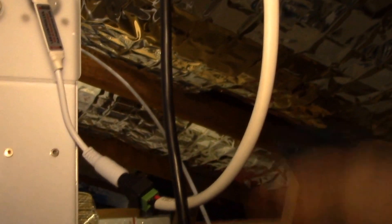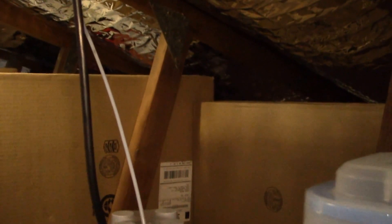That should work a lot better and it'll be easier to change filaments — I'll just pull the tube out, it'll be loose at this end, and I can feed the filament through the tube and shove it through the filter in the back. The other change I want to make is putting the feed-throughs up high instead of down low, to cut down on the amount of bending in that guide tube. Every bend adds friction, so if I can come off the top instead of the bottom I'll get a much better feed.